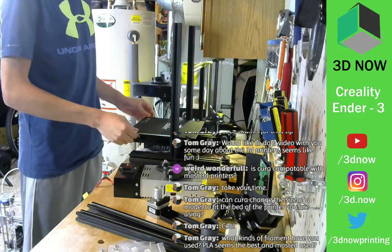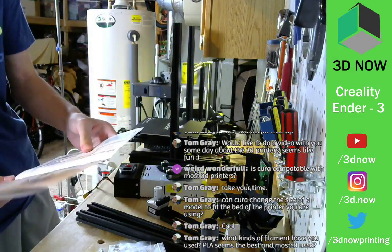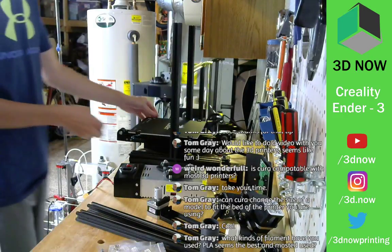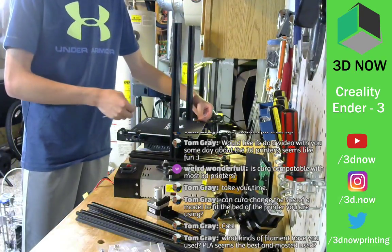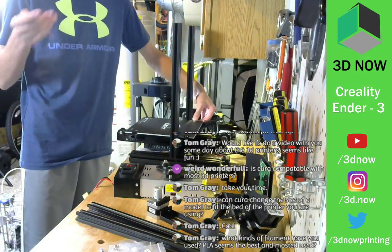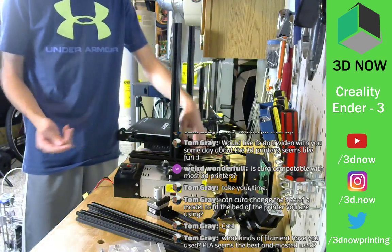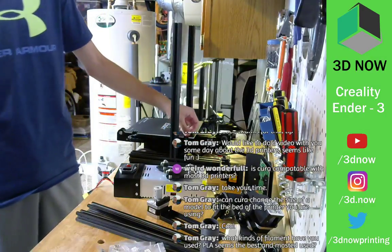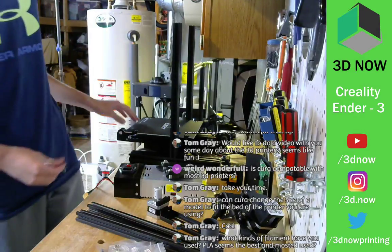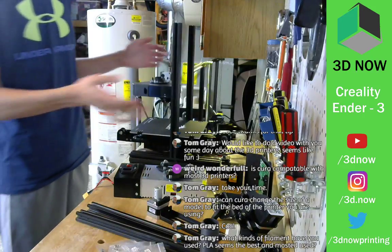So yeah, there are a lot of materials to print with. But mostly start out with PLA because that's the easiest, cheapest, and it just works. When you're printing, for example, ABS, it's super hard to print with. You might need an enclosure. It warps. Also, HIPS, H-I-P-S, is also a material. It has a very matte finish. It's also super hard to print with. You need an enclosure to trap a lot of heat into the print area.